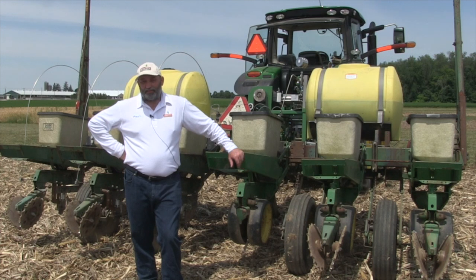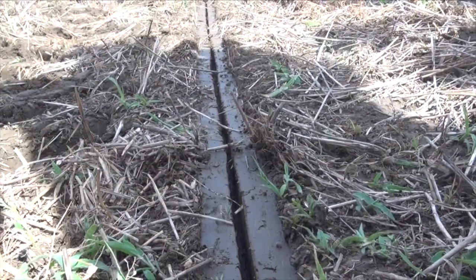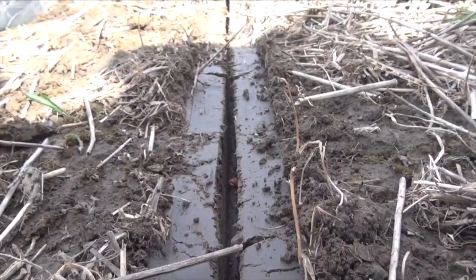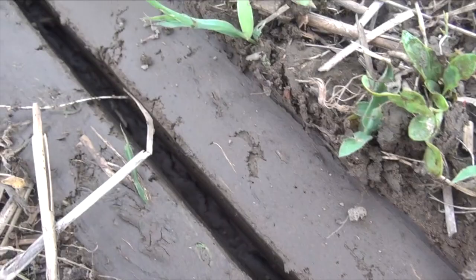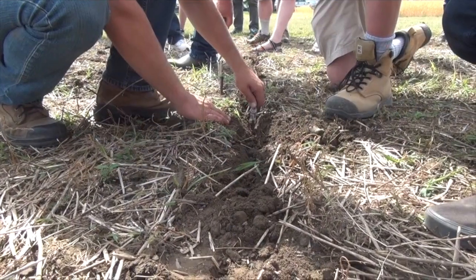The technology for making that pressure is off-the-shelf, about 30 years old — we don't have to reinvent that. It's really about the ground engagement tools and getting the cutting right. We've spent a fair bit of time increasing the efficacy; since we first started we've achieved about three times the cutting power for the same-sized nozzle. It's important to hold the residue and put some compression into it so there aren't a lot of air spaces. We've also found that it cuts wet residue better than dry, which is unlike any other mechanical device or coulter we've seen.